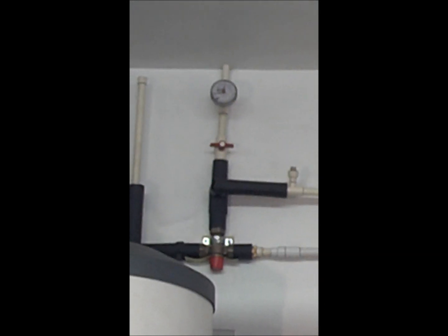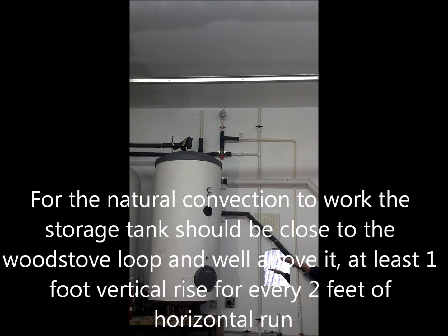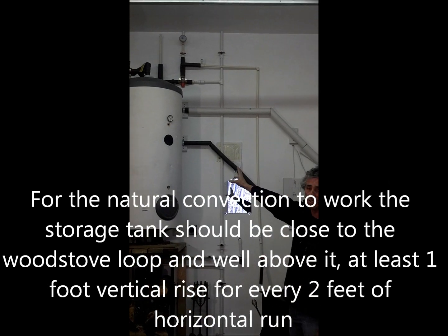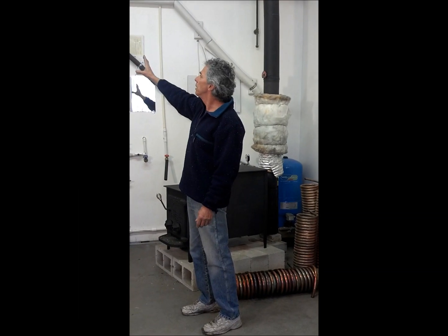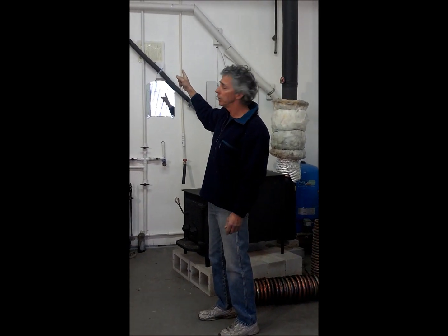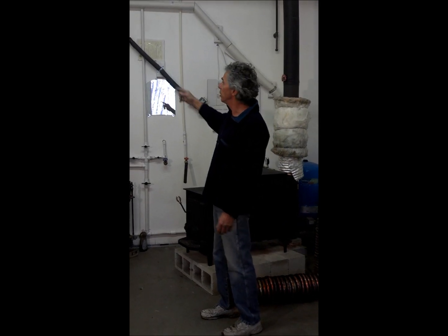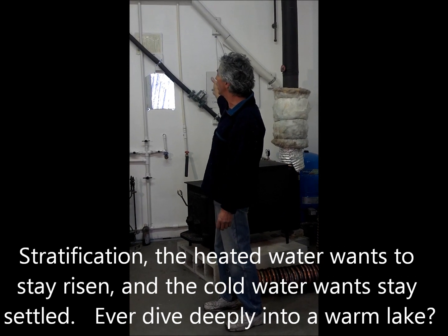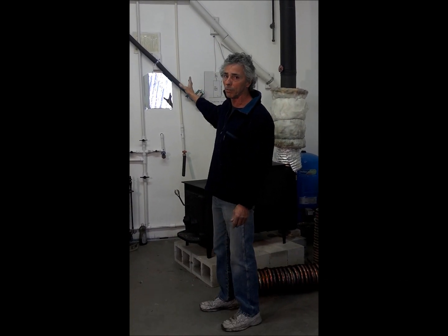You're going to be dealing with water a lot hotter than 120 degrees — I can almost guarantee it. Because it is an elevated tank system taking advantage of thermosyphon, when the tanks are cold — if I had gone away for a while and come back and this tank is down to maybe 55 degrees — there's not going to be any water flow in the loop other than the water settled in the loop. It's not going anywhere. And if you have the hot water tank on at that point, there's no draw on that either; there's no way for the hot water to come down the upper line and feed through there.